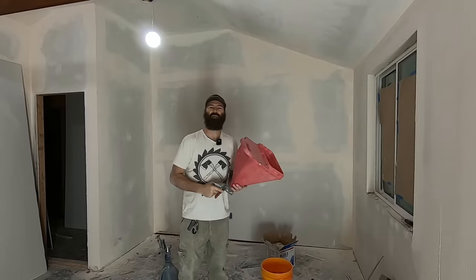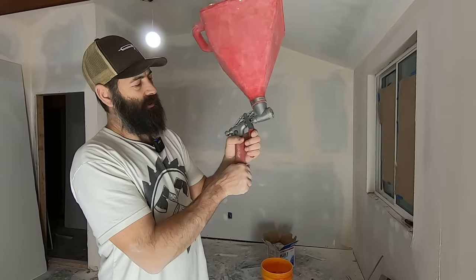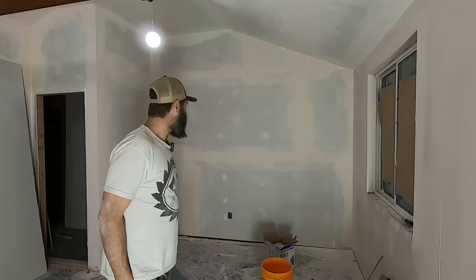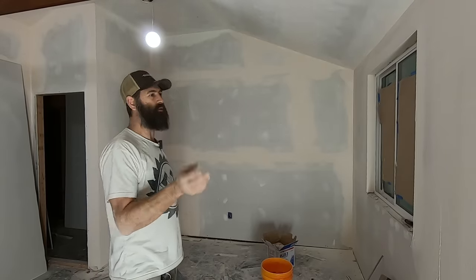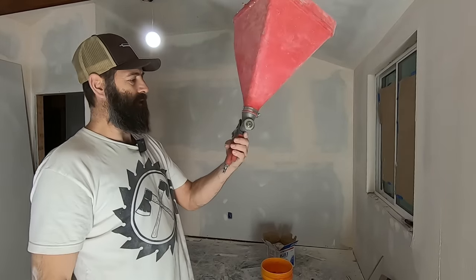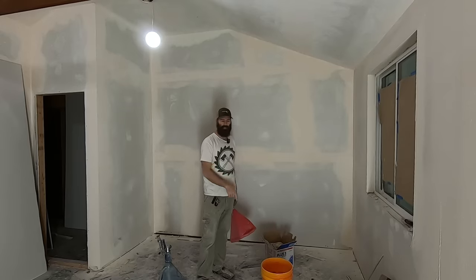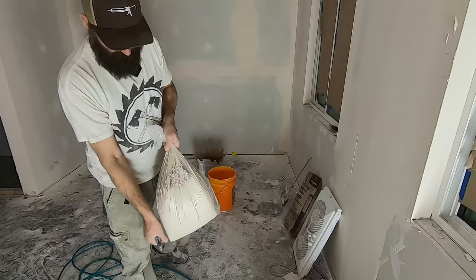This one here — my good one, old faithful. Can't believe it — I found it actually cleaned from the last time I did drywall, which is not normal. You just plug your hose in there and this handle controls the airflow and the flow of the joint compound. I keep saying joint compound — it's texture — there are multiple uses for it. I'm not gonna mask anything off. I've got a sheet of drywall to move around and cover up the windows. I still have not sanded the walls on purpose because I knew there would be overspray — you can just run a machine right across it and it goes right away, or scrape it off. I've had this tool for over a decade. I have some standard joint compound here; I'm gonna put all of it in a bucket, add a bunch of water, and mix it up really thin.